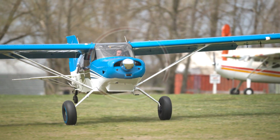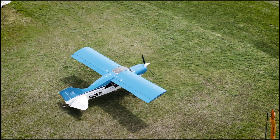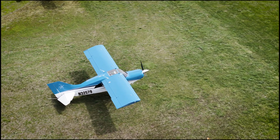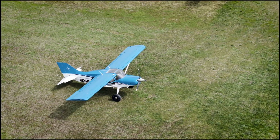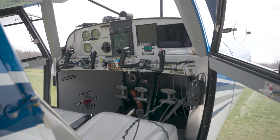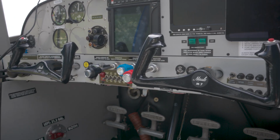All right, so my buddy Alec stopped over, and it's a 2022 M9 260. It's got an IO-540, which is 260 horsepower, Maule 80-inch 3-blade props, a Garmin 750, the JPI 930, which is the engine monitor stuff, which is really, really cool, and 26-inch bush wheels. The useful load on this thing is 1338. Max takeoff weight, I think, is 2,800.